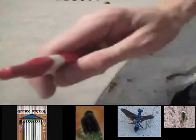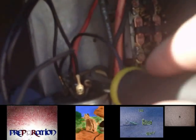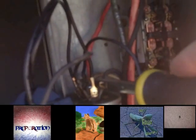Now that the power is disconnected, what we're going to do is take our screwdriver and hold only the insulated portion of the screwdriver, making sure we're not touching the metal at all. We're going to bridge the leads on the capacitor. That'll discharge any charge that's held in the capacitor so that we can safely work on the system.